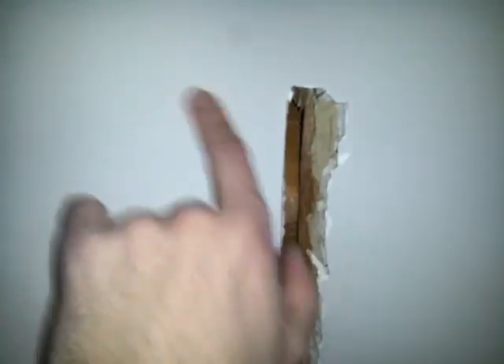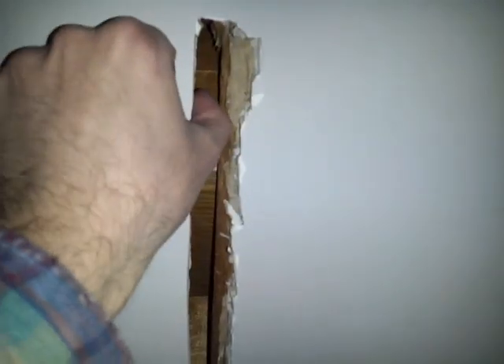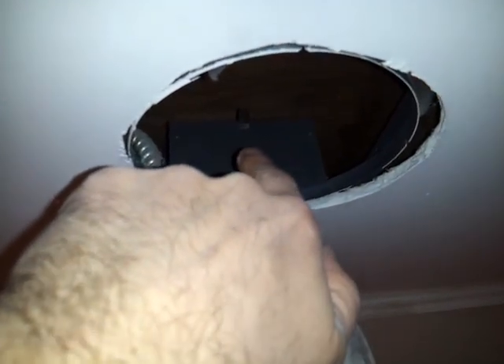What I did here was I want a light right here, so I'm going to put that casing in here and fix it to the sheetrock. I had a hi-hat here so I just pulled it out. I'm going to use the junction box in there to connect the wires and sneak them up through there. I just made a little hole here to go through and up through the sheetrock, and I'm going to staple the Romex in here.